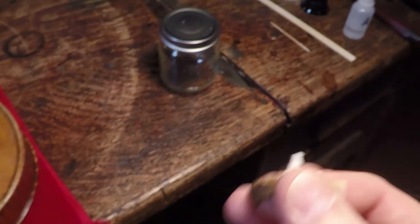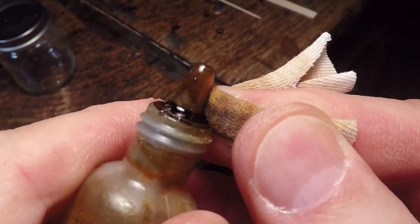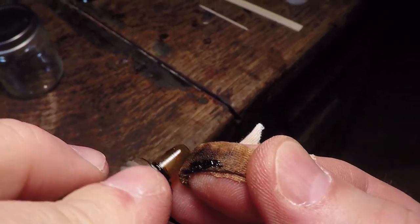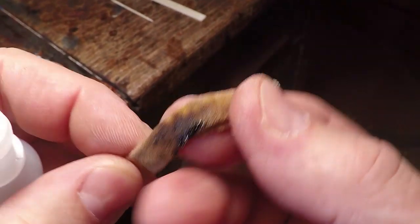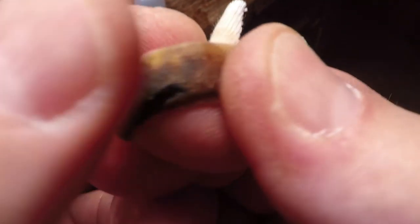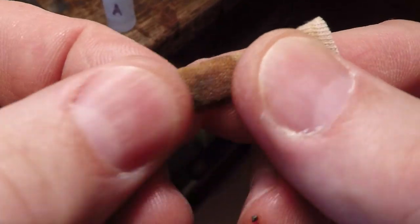This has been a big project, but we're now headed down the home stretch, and it's time to pull out the thick, dark touch-up varnish again. It may look pretty grubby on the tip of this squeeze bottle, but it really is wonderful, and a little alcohol is all it takes to make it any consistency that we want. I really do get into it, and I do anything it takes to even the varnish out and to feel that the varnish in the cloth is just right.